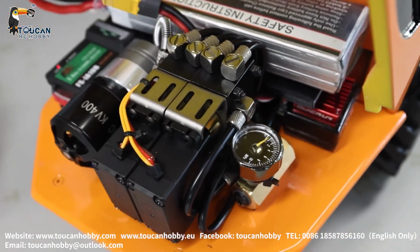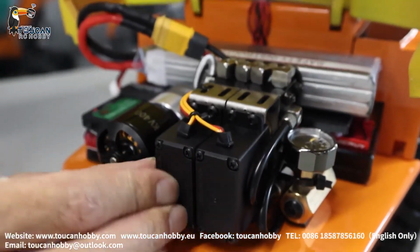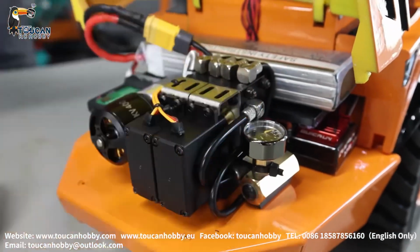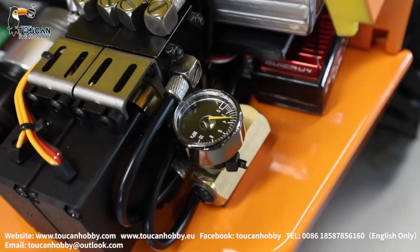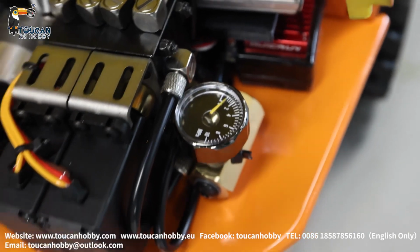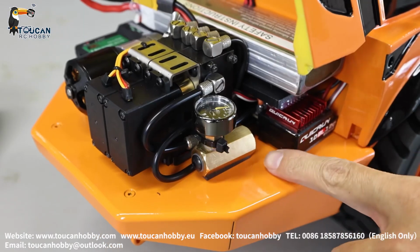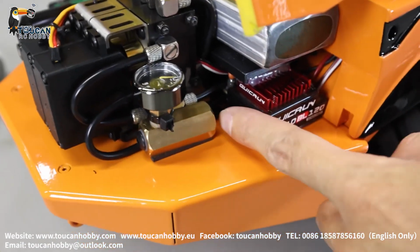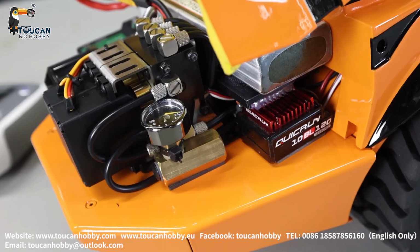And two valve with these two servo. Let's see, outside it is plastic, inside it's all metal gear. See the pressure gauge, start the pump. So around almost 3.5 MPa. So the pressure it is already adjusted, better not to change it. Here that's the pressure valve with the pressure gauge. So inside here have a screw. If you screw in more, will be more pressure. But 3 MPa it is enough.